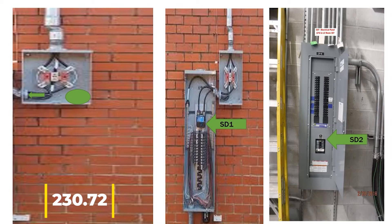We're getting ready to come back into panel season and I just want this to be fresh on our minds. The NEC requires that the up to six service disconnects be grouped together — the service disconnects must be grouped together. Now if you were doing a double-disconnect scenario and then going to the panels, you could put those two panels wherever you want. But in this case, those main breakers are actually the service disconnects.